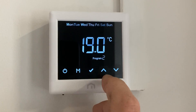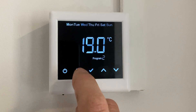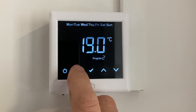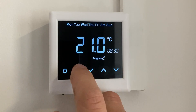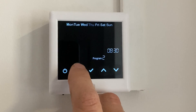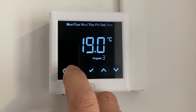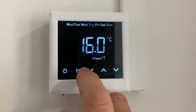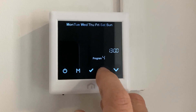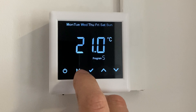Moving into time two, I'm actually just going to put them all at the same temperatures for this particular example, because we're going to do it as an occupied home for the whole day. So we're going to move over and change that one to 21 degrees — from 6:30 to 8:30, then from 8:30 to 11:30 at 21 degrees. Just going to keep the time the same here, take that to 21, and do the same for the whole day, going through the different programs to keep it at a steady state.